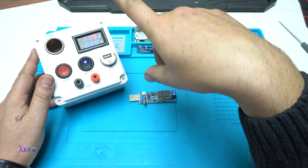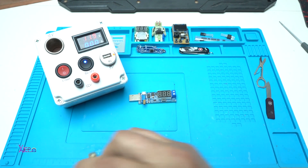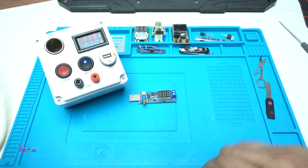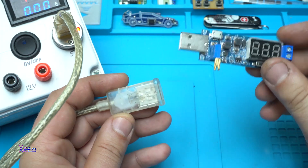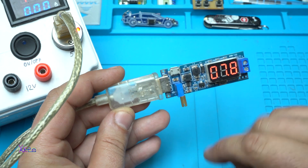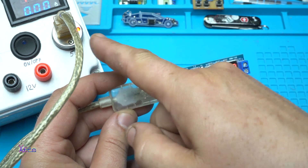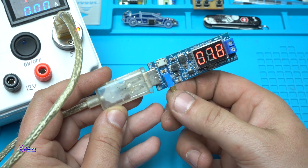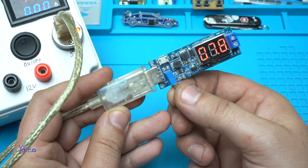But now I'm gonna use 5 volts USB. I'm also using an extension cable right here. It's working — it's giving 7.8 volts. We are converting from 5 volts up to 7.8 volts, and you can increase the voltage by adjusting the multi-turn potentiometer.